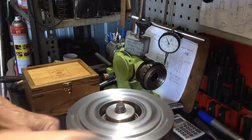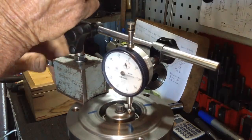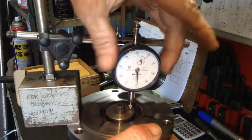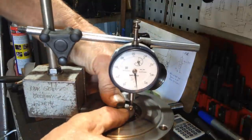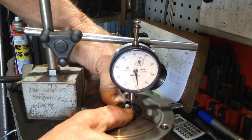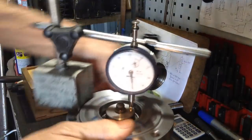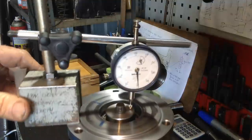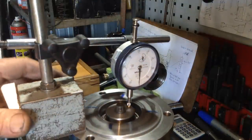Now what I should be doing now is actually using a torque wrench on that. So we're pulling this retainer down to this exact same amount every time. Make sure our bearings' lower cone rollers are seated. So we're pulling that to 0.02 now. Okay, let me go and get a torque wrench set up, and then we can be sure we're pulling this to the exact same tension every time we try it.